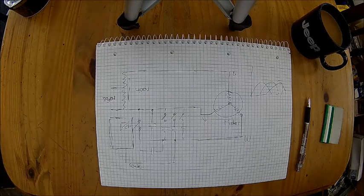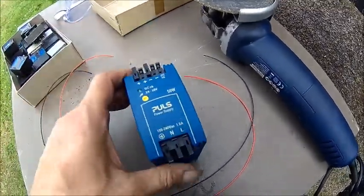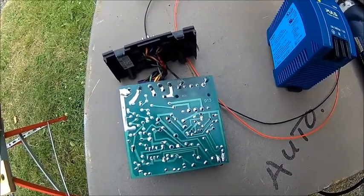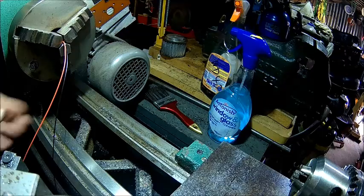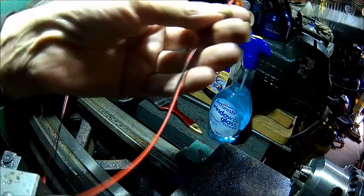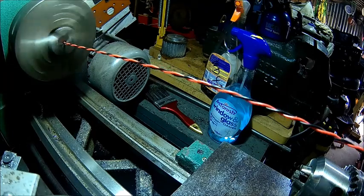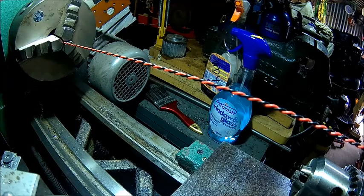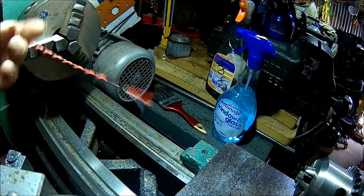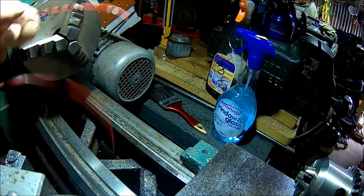Well, we got loads of transformers but nothing fits. So I came up with this idea: I got a 24-volt power supply, some wires to get the transformer out, and I'll just feed 24 volt DC in. That should do it so we can carry on doing what we want to do. If you ever wondered how you twist these cables, you can do it with a power drill, but I don't have one on hand right now — you just hold the end. Now we're going to solder that to the other side, drill a hole in the enclosure, and connect this side to the power supply.